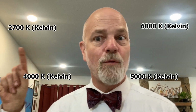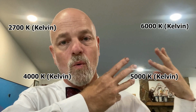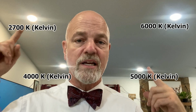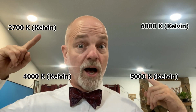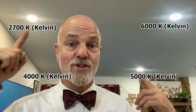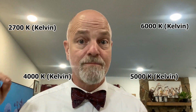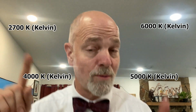Now, so we say, well, why don't we all just go to this kind of light? Well, some people need a little more of a whiter light. So we go to the 5,000 Kelvin. And a lot of people use 5,000 Kelvin. However, these two lights, I'm going to go on these two extremes right here, because these two lights are the common ones you run into when you're out there looking at the world, you're in your house, you probably have mostly these two. And so what happens is there is a place for a higher Kelvin light and a lower Kelvin light. And so, like, the lower Kelvin light is actually more relaxing to the human brain, to most human brains, okay?